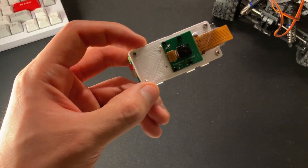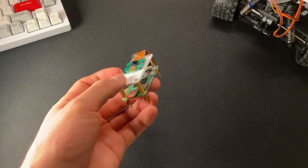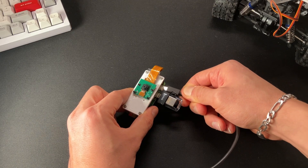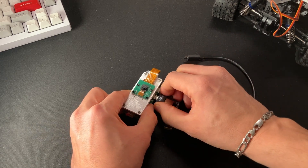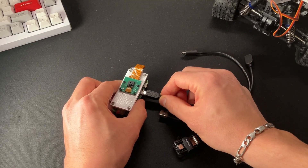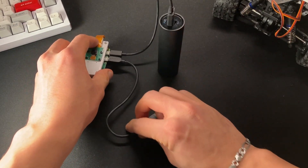Here's what the final assembly looks like — you can see the 3D printed part as a support for the RPi camera and the ribbon cable connected to the camera and the Raspberry Pi. I noticed a problem with the cables because the USB stick wouldn't fit together with the charging cable, so I found this adapter that converts micro USB male to female, allowing me to connect both the charging cable and the USB stick.